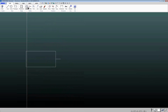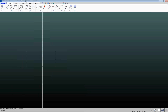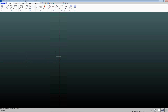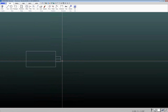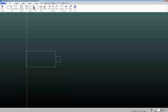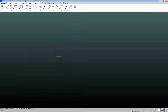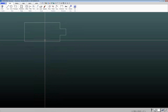And then you can do things up here, like, again, all basic 2D CAD functions, the offset command. Down here at the bottom, it's prompting me for a value. I want to offset this line 1 inch, so just type 1, okay, click on the line, and then move your mouse up, left click, and then you can click on it again and move it down that way. And then we can do a line, endpoint to endpoint. I want to trim something up. Up here, I've got a trim command, or as I hover over that, I can do T for trim, and you can get rid of that. So it's very easy to draw basic 2D stuff in here.